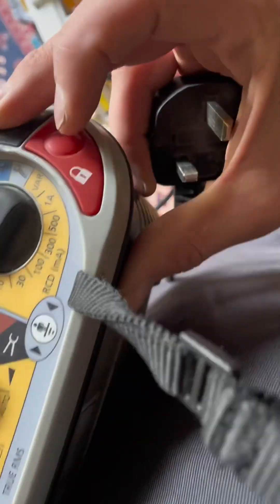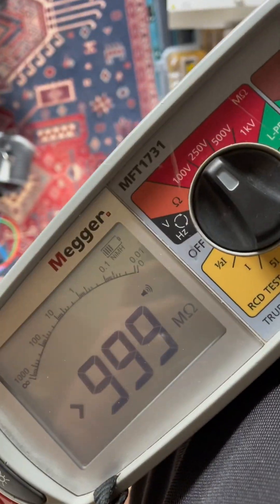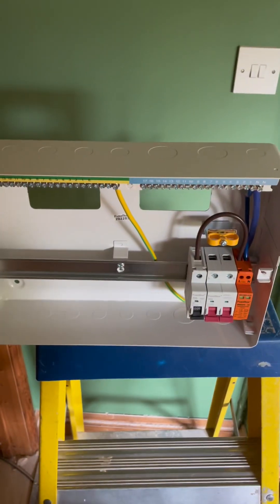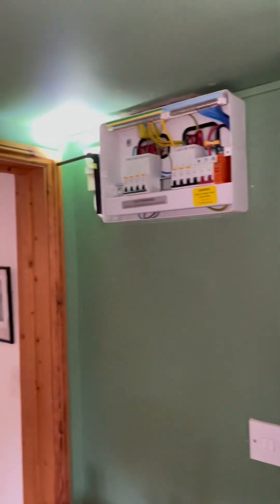If you didn't already know, you can press the lock button on the insulation resistance tester, do all your tests, and then to turn it off just press test again and it unlocks - really handy when you're on your own. The powers that be have dictated that we rewire this one, so just going to channel down and then grommet trim out of the board, Bosch it on, get all the CPCs in etc - the usual way. Retest it - there's only a couple of things we found: a broken flex outlet and a light hanging from the ceiling. I think their water heater was oversized for their supply but it has been tripping. Board's done.